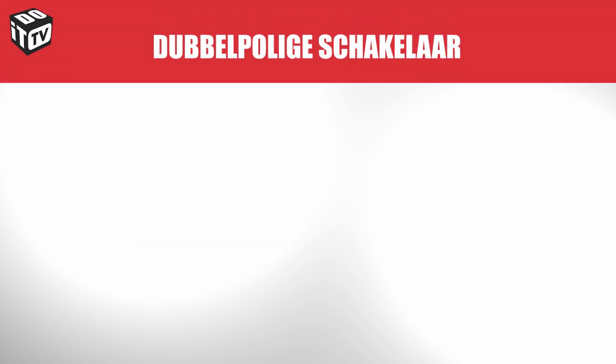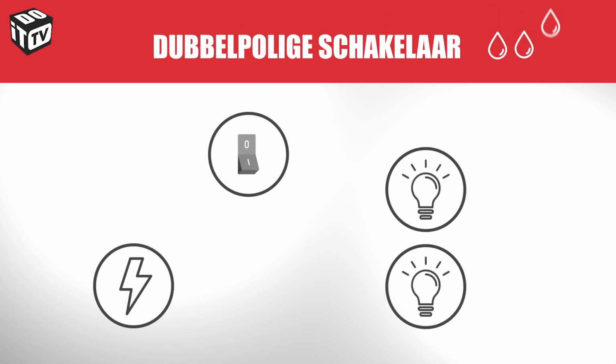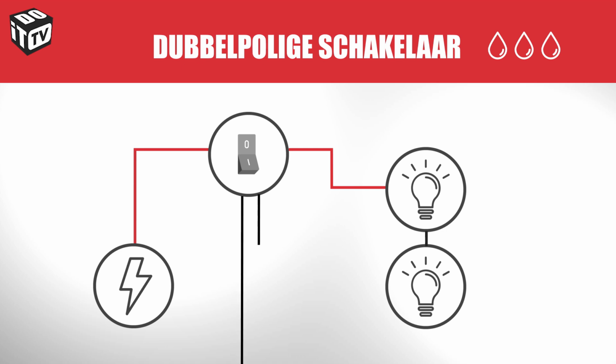The double-pole switches do the same as a single-pole switch, but are typically used in damp areas. Just like the single-pole switch, they have a phase and switch wire, but in addition, there are also 2 connections for the incoming and outgoing neutral wire.